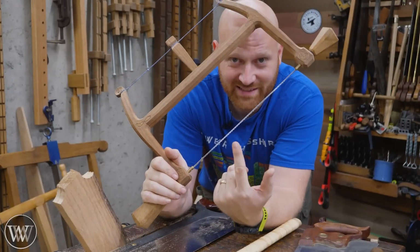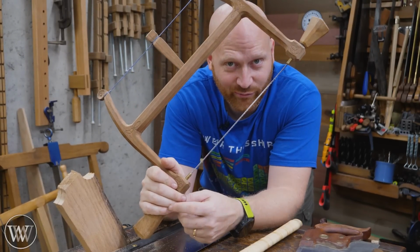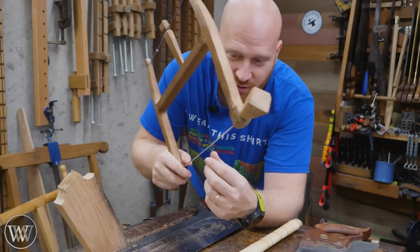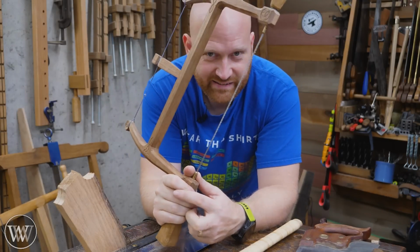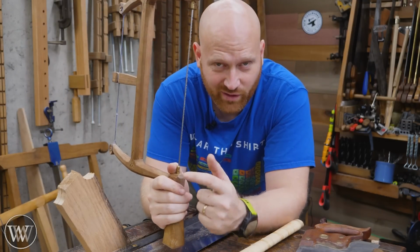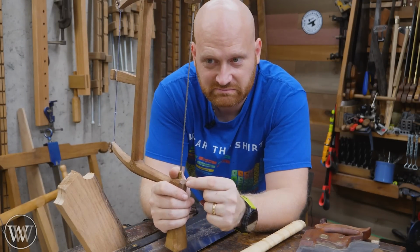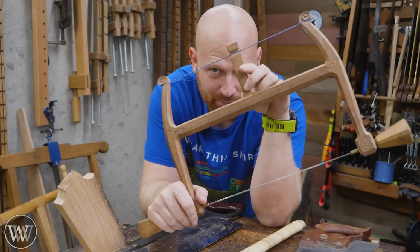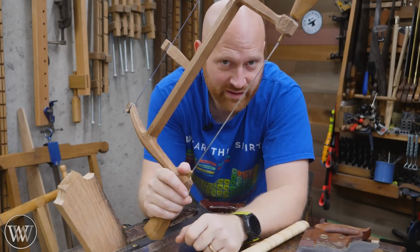It can be a surprisingly efficient saw and can cut through a lot of wood really quickly if you just let it do the work. If you're putting it into it and you're bending the blade a lot, then it's going to be doing some weird things on you. You want to try and not bend the blade, and it will actually do much better work if it's kept straight. And that's why you want to keep it in good tension so that the blade doesn't want to bend as much.